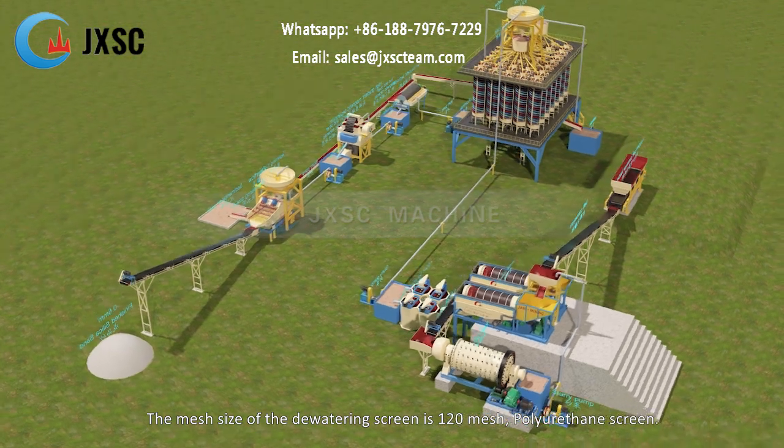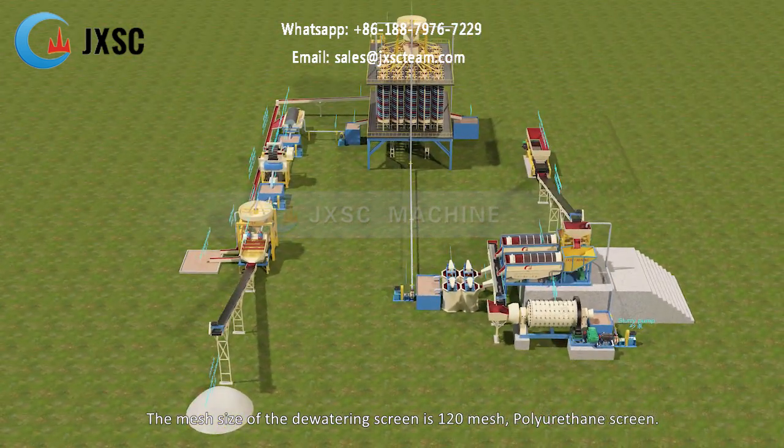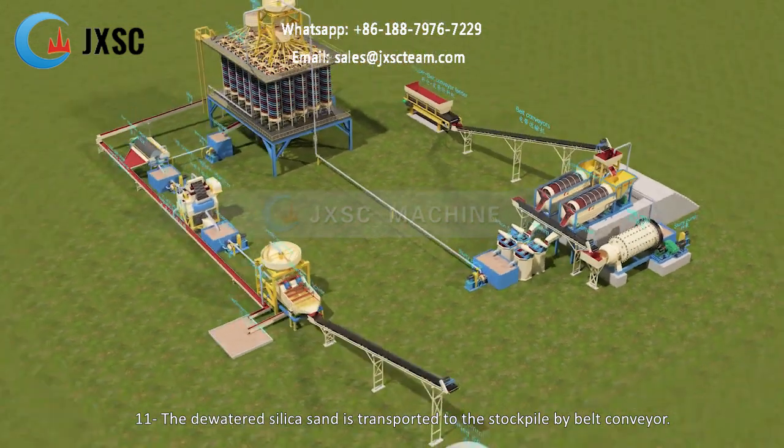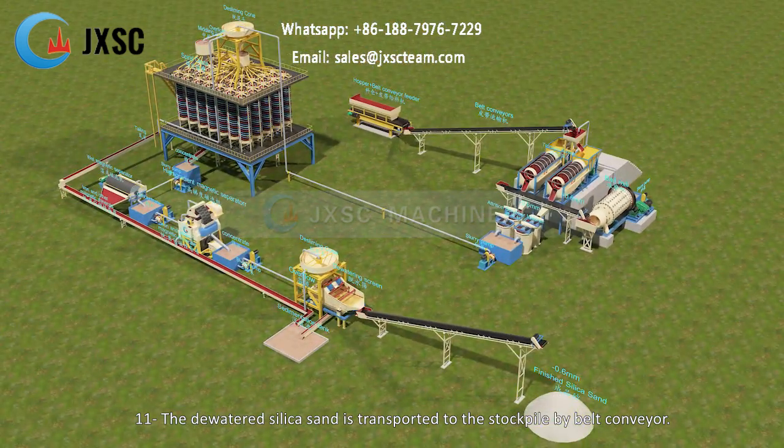10. The underflow of desliming cones goes to the dewatering screen for dewatering finished silica sand. The mesh size of the dewatering screen is 120 mesh, polyurethane screen. 11. The dewatered silica sand is transported to the stockpile by belt conveyor.